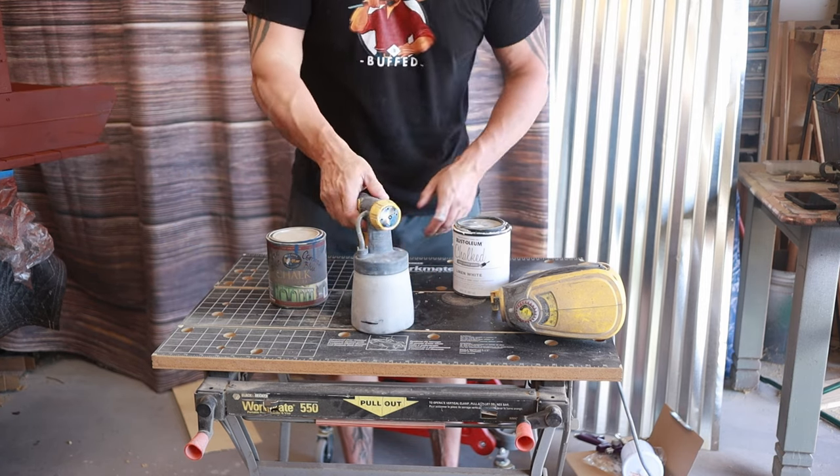As you've seen I got it sanded down smooth, got it distressed — it looks aged, kind of farmhouse. If you're a beginner, starting off with chalk paint is very forgiving because even if you get a dry spot, orange peel, or a run, you just sand it down, it turns into a powder, and you can correct it. Put another coat on if you need to. Latex paints you can't do that with because they'll start peeling as you sand. So chalk paint is very forgiving for first timers. We've got it sanded, primed, painted, and distressed — now it's time to seal it.